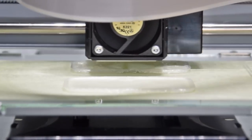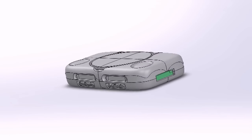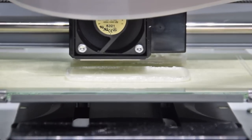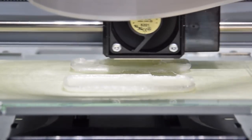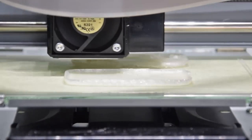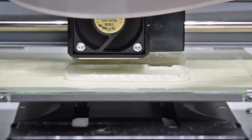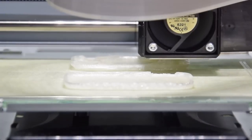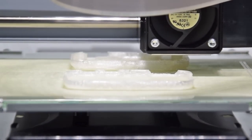This case will be a simple two-part case. The rounded shape of the case will allow us to print it without supports. It's not the ideal way to print it and it will create defects. However, it will be a big time save over having to deburr the supports. The print was set on the highest quality possible, with a layer height of 0.2 millimeters, which should be thin enough. It's printed at 100% density, because it will be sanded later on.